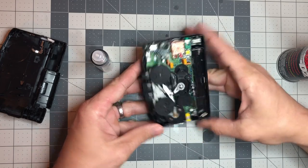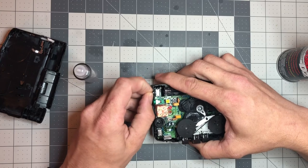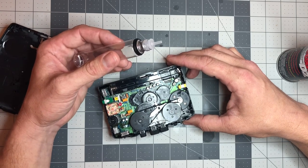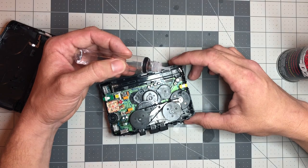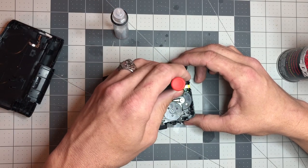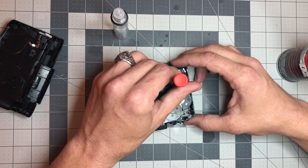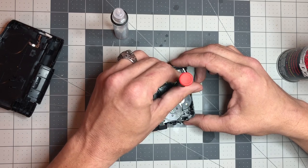I've got this other one here — there's the last one. Now for the speed adjustment, it's important to clean this before you adjust it. I've seen people make a speed adjustment and complain their Walkman is either too fast or too slow and they can't get it quite right. That's because the sweet spot where it's been sitting for twenty years is the part that's gummed up. Unless you clean it, it'll continue to have erratic operation when you adjust it. Just dab the deoxid on there, get your jeweler's screwdriver, and work it back and forth to break all that gunk off.